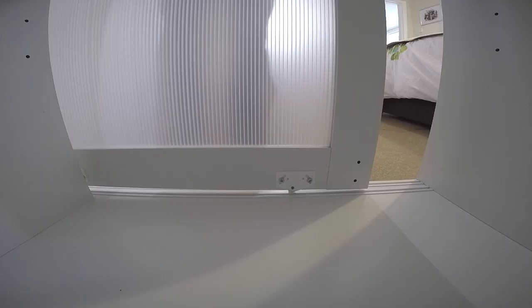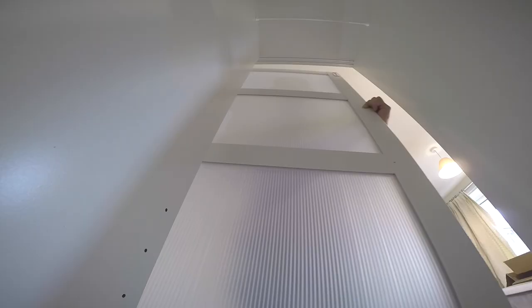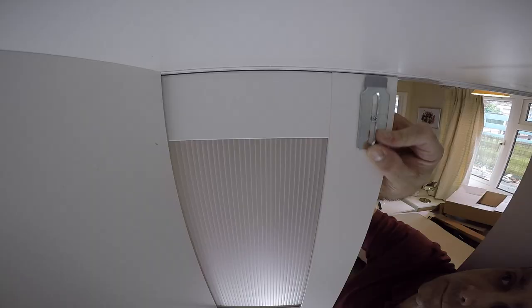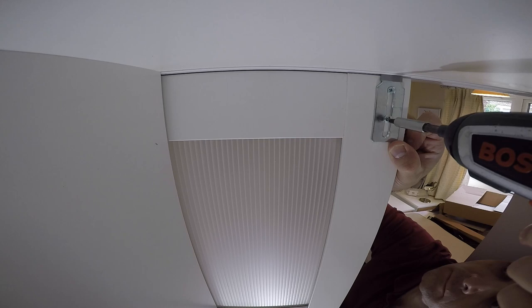We can position the first door — the inner doors. Just slide them into the rail; when they're sliding easy you're in the right position. It's just a hook coming into the rail and sliding nicely. Place the top in the rail — push it up, secure the top screw, and the bottom screw as well. These doors are secured so the doors won't fall out of the frame.